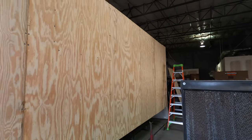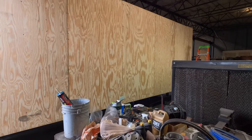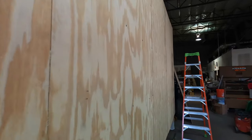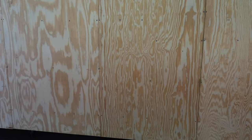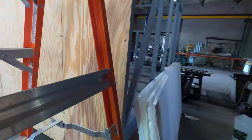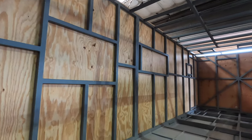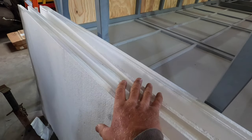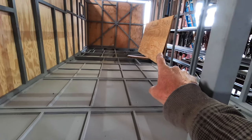This is what the driver's side looks like now. Still got to trim the top off and trim the bottom — I'm going to route both of those off after lunch. There's a lot of plywood, everything's glued and screwed, so it shouldn't rattle, it shouldn't move, and we've got a lot of extra shear strength from this plywood. Here's the insulation — it's going to go in these gaps and that goes over the top.